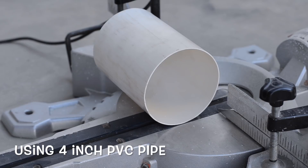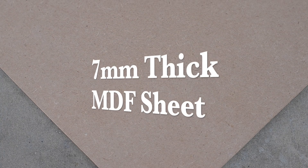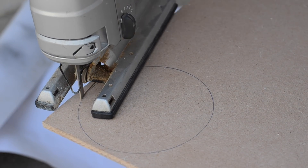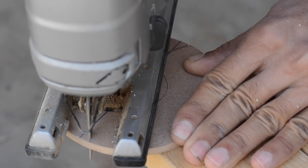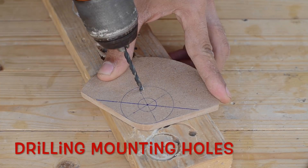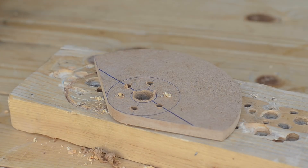To prevent any injuries while operating this angle grinder, we are going to make a blade guard out of a four inch PVC pipe as well as a seven mm thick MDF sheet. After measuring the distance between the mounting holes of the motor, we are going to drill six holes in the guard plate so that we can mount the guard on the motor in different orientations, as per the convenience of using this angle grinder.